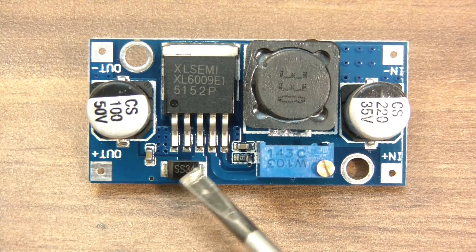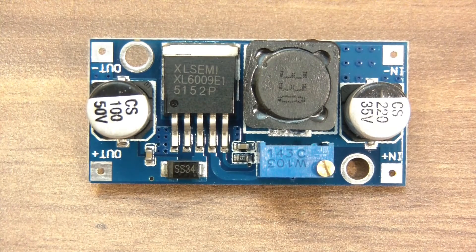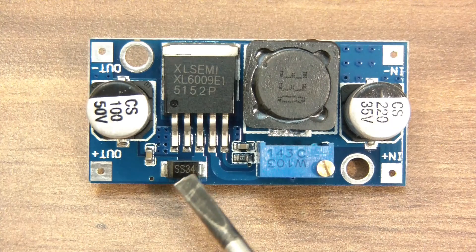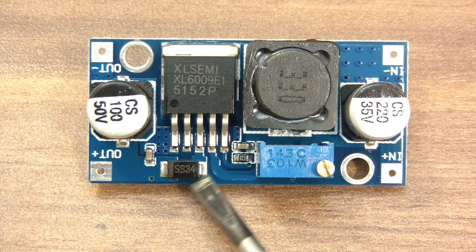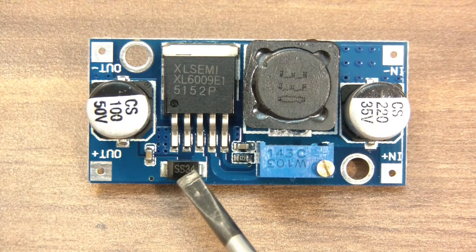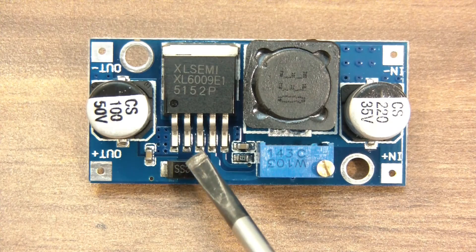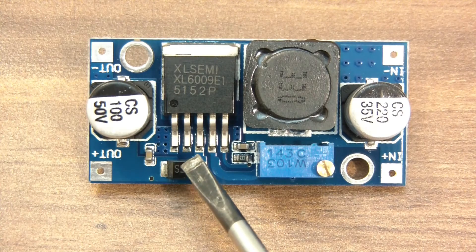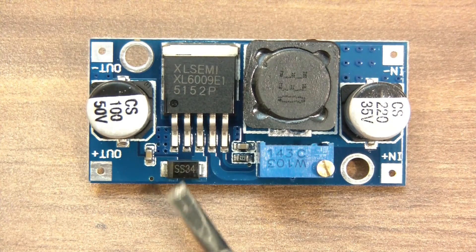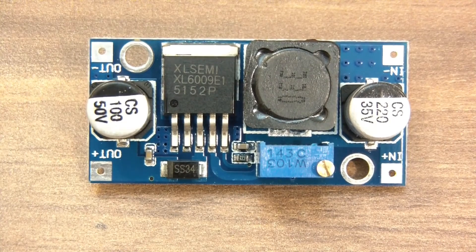Maybe we could do an upgrade of some sort. I already upgraded to this diode but it didn't work, probably because it's not the correct type. But if we were to get two of these diodes and place them in parallel, that might work — hopefully only 50% of the current would pass through each one, so not as much heat would be generated. These are good, but I think that diode needs to be upgraded and it should be fine. I hope you found this review helpful and thank you for watching. Bye!